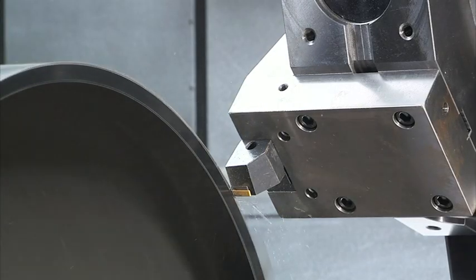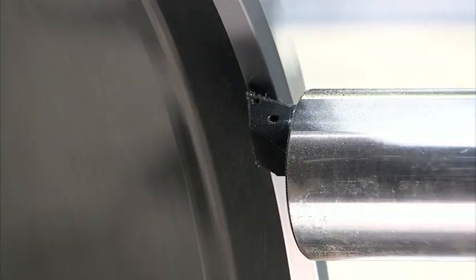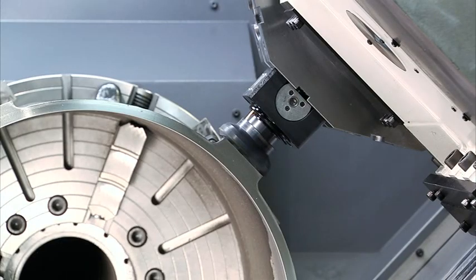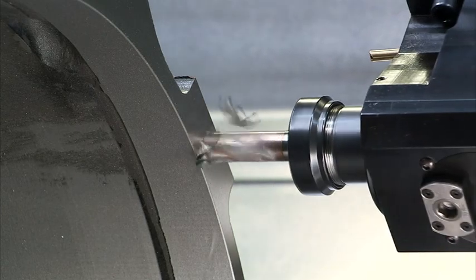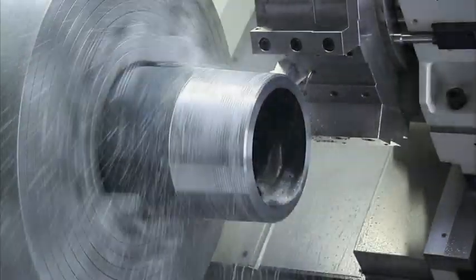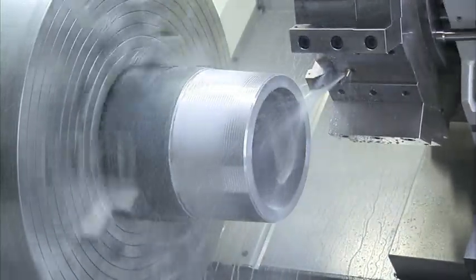The FBL-530MC, with its superior quality and versatility, earns its position as an elite multifunction CNC turning center. Specifically designed for large component machining with its rigid slant bed design, massive high-torque, high-speed spindle, and highly rigid, versatile 12-tool powered turret, the FBL-530MC is well suited to become an integral part of your machining operations.